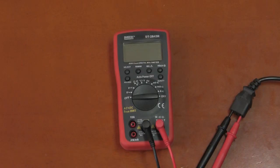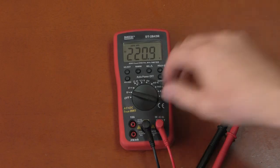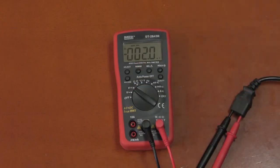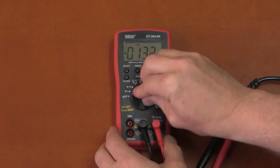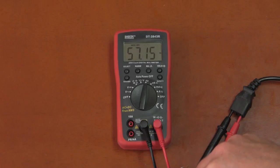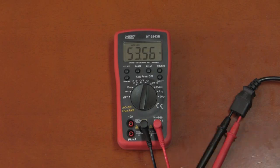Testing abuse tolerance: first, measuring AC voltage from the wall — no problem. Putting it on DC volts — no problems. On ohms, it displays nonsense. Continuity goes a little crazy. Diode check, capacitance, temperature, and frequency inputs — the frequency position is probably beyond the input voltage range it wants for frequency measurement. Back to AC, it takes a few seconds to recover but is fine. No problem handling wrong voltages on other inputs.